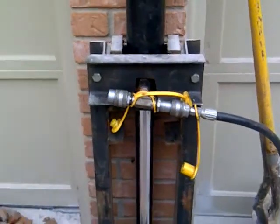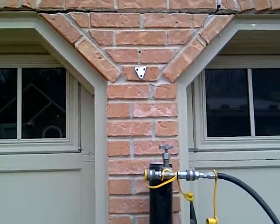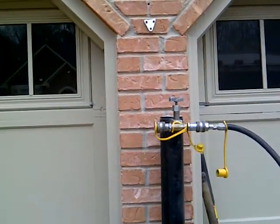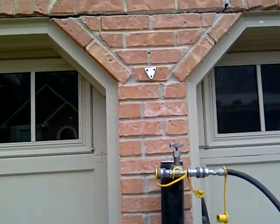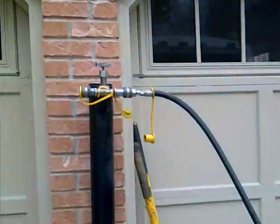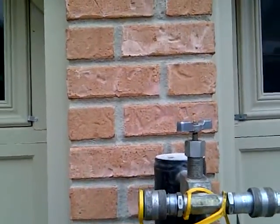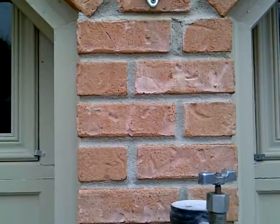What we'll demonstrate now is I want to film this brick garage column coming up, just to show you that you need to get upward lift to stabilize this brick wall. If you don't get lift, you never know if you have it stable. So we're going to crank the machine up, and when I press the button, it should be able to show this brick wall coming up.